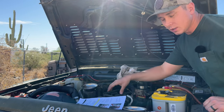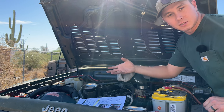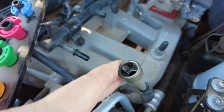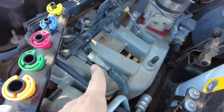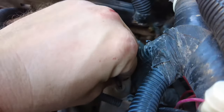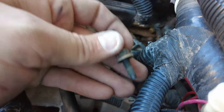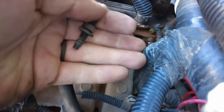We're going to get started on tearing the Jeep apart. The instructions make it extremely easy, but if I run into any issues or tips and tricks to make this install faster I'll let you guys know. You will need one of these hose removal kits because the fitting for the fuel line that goes onto the fuel rail has teeth in it that grip onto the fuel rail and hold itself on — I'll have a link to one in the description. Also, this last bolt that holds the fuel rail on is double sided. You take the nut off the top that holds the clamp for the wire and then remove the double sided bolt to remove the fuel rail.